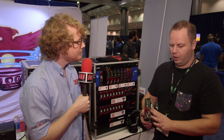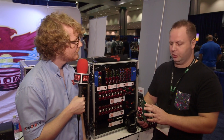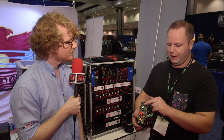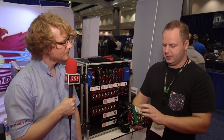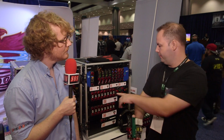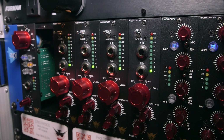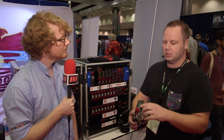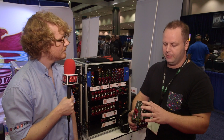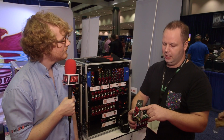So this is our new product, which is the Pivot Tone channel in the API 500 series format. At the top we have a switch for line or DI, and the line amp is basically our balanced line input from the Nicerizer summing mixer. The DI, which is our DI as found in our other mic pre products, has a very high impedance, which means it sounds great on pretty much any instrument. And then again, the interesting part is the EQ.